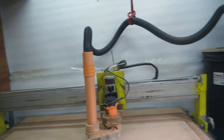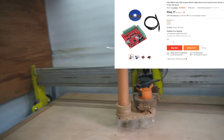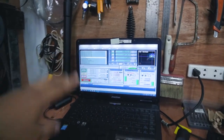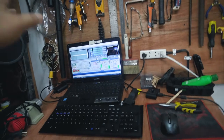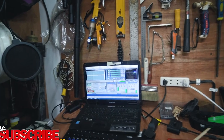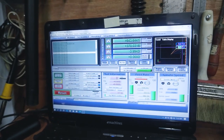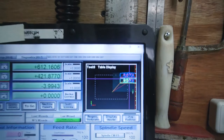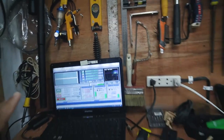The whole machine is controlled by a USB Mach3 controller, and the stepper motors are driven by a TB6600 driver. It runs with Mach3 software on my old laptop — the keyboard is broken but I use an external mouse and keyboard. Right now it's cutting that sign, but I didn't turn on the router so it's just doing an air run.